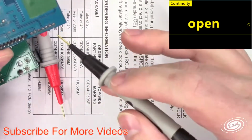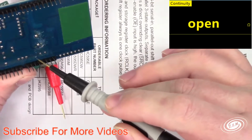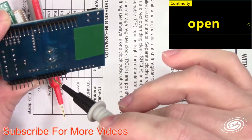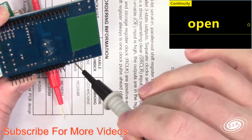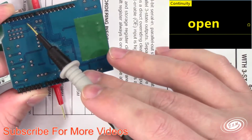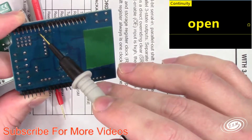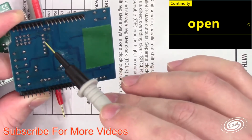And that's the only two tracks on this side, is this power track that goes, you know, to this potentiometer and this 5-volt rail here and goes to this pin, giving you 5 volts. This one, you can see, shoots down, pops up in front of 6, pops back down, and goes to 1. So maybe not multi-layered, just 2-layered. So it has to jump this track right here.